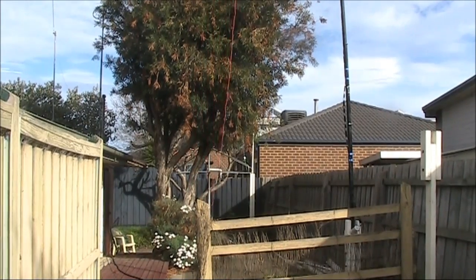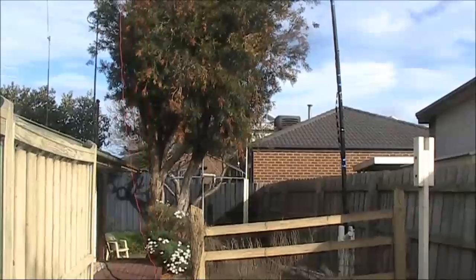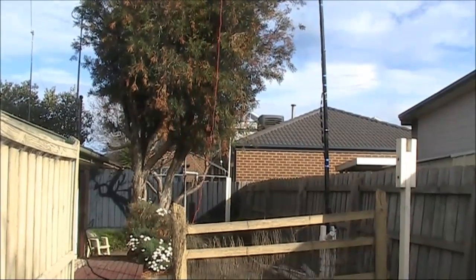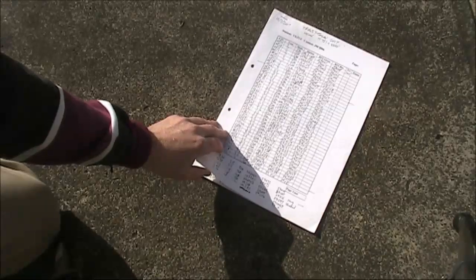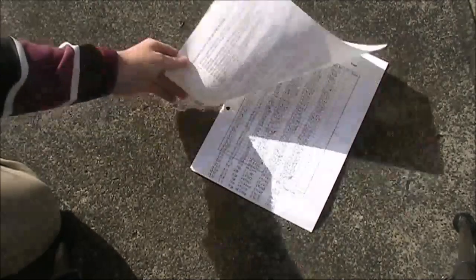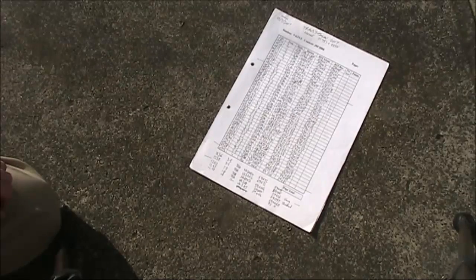This is my solution for an antenna mast in a small yard — 12 metres tall, yet if required it can be collapsed even below the fence line. That could be useful in high winds or when the landlord is around to inspect. As for results, here's the log from the recent VK Trans-Tasman Contest, with contacts made on 160, 80, and 40 metres. Nearly 100 contacts were made over about three hours of casual operating, with distances worked up to approximately 3,000 kilometres.